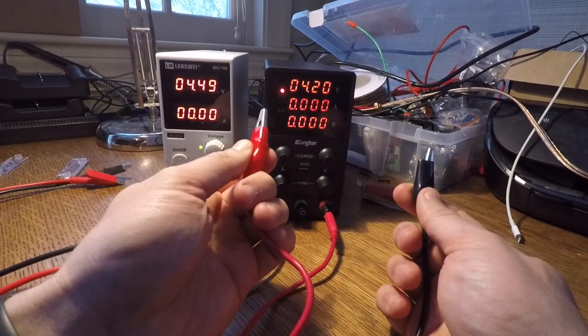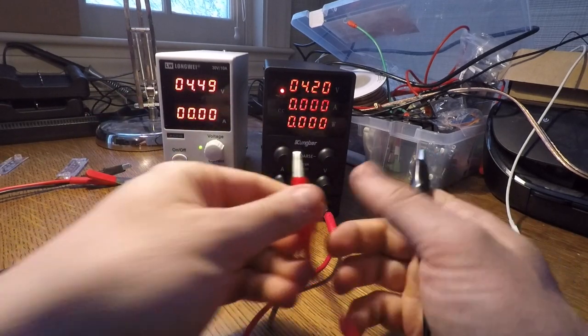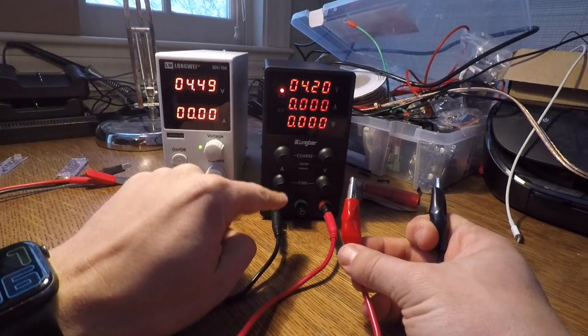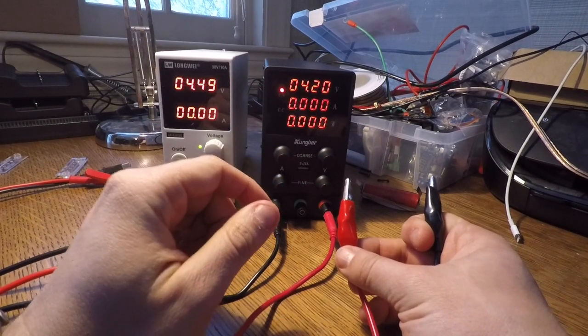So that's what you want to do before you charge things — set your maximum voltage without the leads connected, and then when they are connected, that's how you adjust current. Important thing to know: if you move any of the knobs, no matter what setting you're in, you are going to adjust the maximums, even if you can't see it.